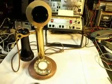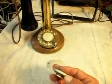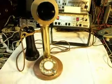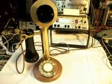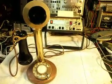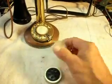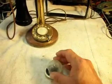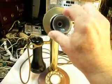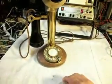This telephone is a mix of old and new parts. I have a transmitter from the 60s and 70s — it's a T1 — and that's the transmitter they're using in the telephone. This telephone does not have a network in it. So in order to balance out the sound quality from the transmitter and the receiver, there's a certain way you have to wire it. This is a bell insert, and basically what you can do with it is cut the top off to fit the spit cup inside, and then cut down the other end to fit over the transmitter.